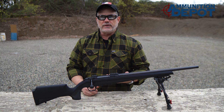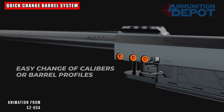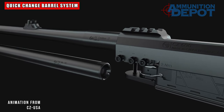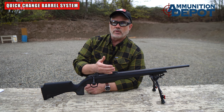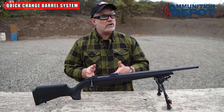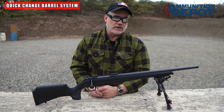One of the most defining features of the CZ600 is its quick-change barrel system, and it's really easy to do. You simply loosen three screws at the bottom of the receiver and the barrel pulls out through the front. The locking lugs of the bolt actually lock in the lugs that are machined into the back of the barrel — it's kind of like a barrel extension on an AR, but it's all one piece. This barrel system lets shooters chamber different cartridges or take the rifle apart for transport, storage, or cleaning.